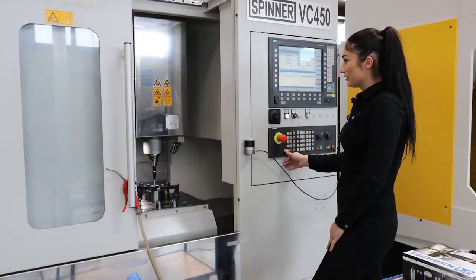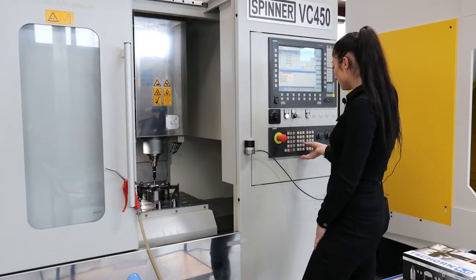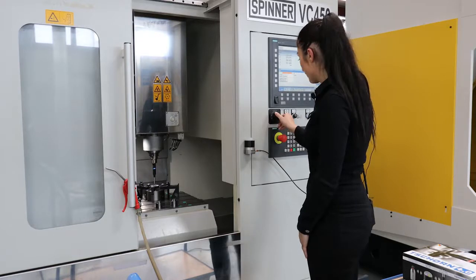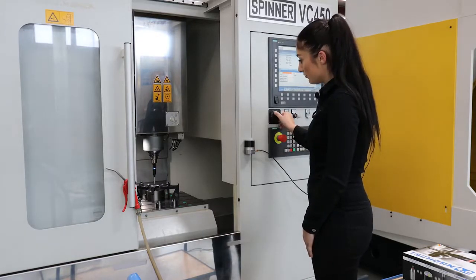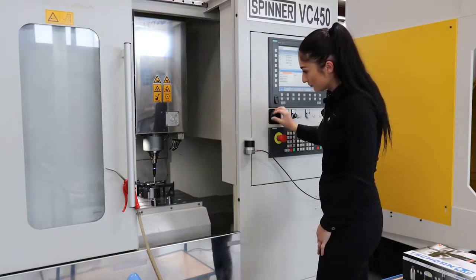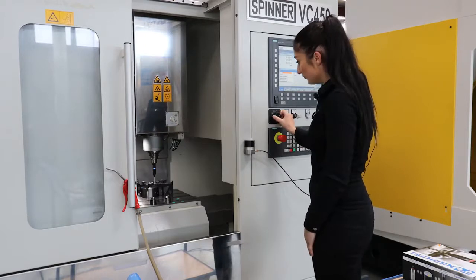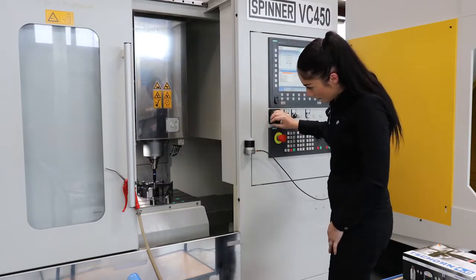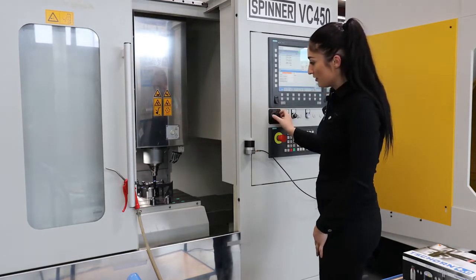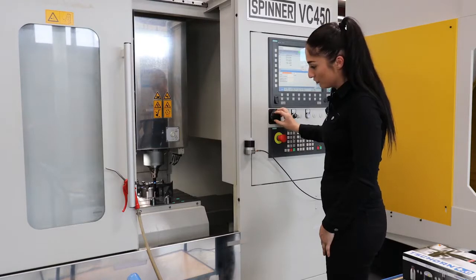Now the calibration in Z is missing. For that I return back to the JOG mode as I have to move out of the ring. I look for any position on the table. Alright. I move the probe carefully down. The good thing is we can see the probe's blue light. It still shines for minutes after the latest probing, which means the probe is switched on for 4 minutes.